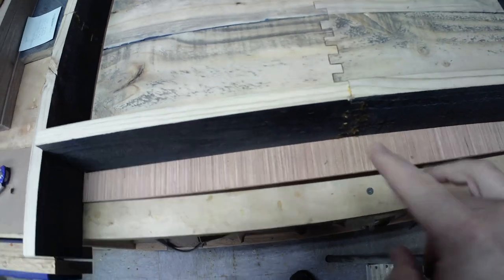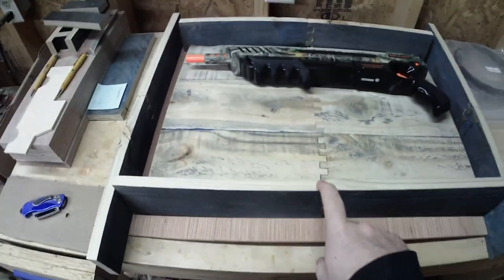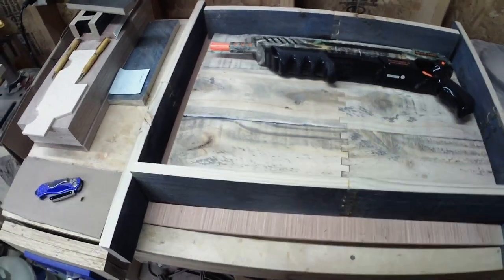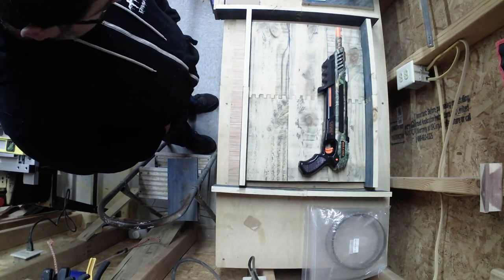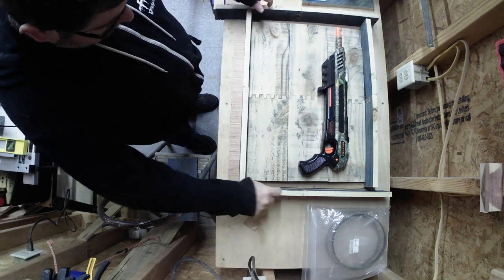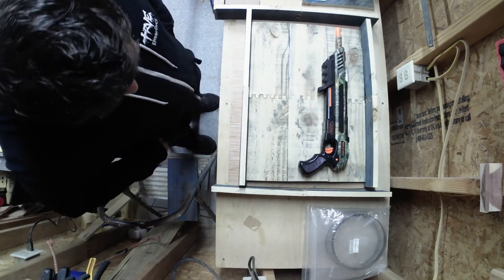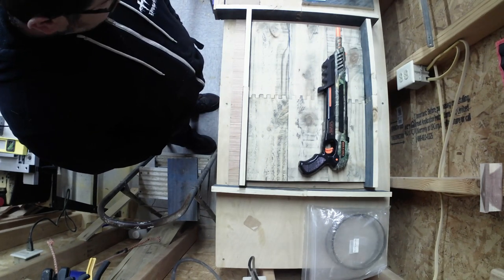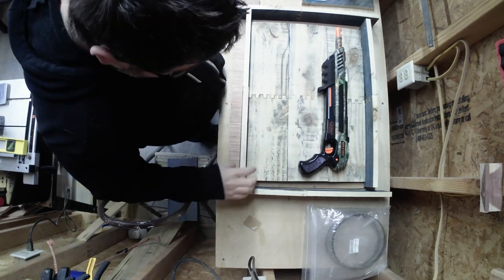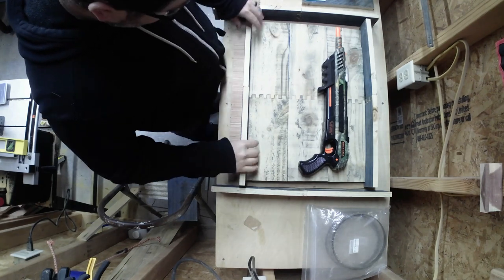These four are now dry, got them glued up. So now, let's put you up here. Now what I need to do is, I think, make these box joints to form the frame around. I need to sand these guys down, actually. Sand these first, because that'll thin them down some from making these box joints a little bit. So sand the glue off of these guys.